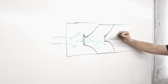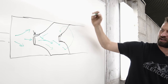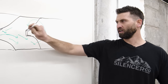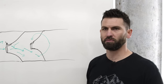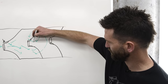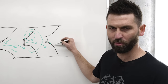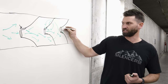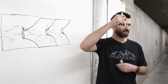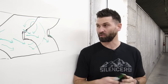More gas is going to go towards the bottom of the next baffle relatively, then through the center. So you're going to have gas coming down via path of least resistance, having to circle back around to get to the larger entry. As we stack baffles that way, we're creating the most delay and the longest path for that gas, and that turbulence encourages mixing of combustible materials, ensuring they burn up faster. If we shift the port to the bottom, we create a cross-jet or vector pushing the gas down. Having ports on the top where they're all aligned creates the longest path for that offset vector, making it travel furthest to reach the next baffle opening.